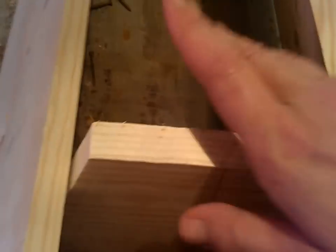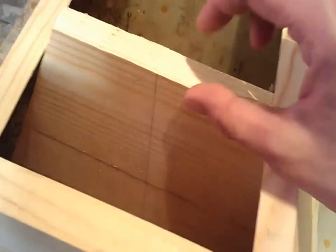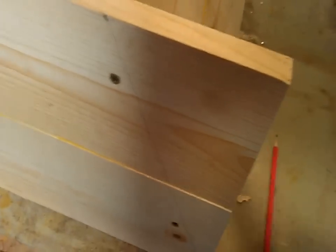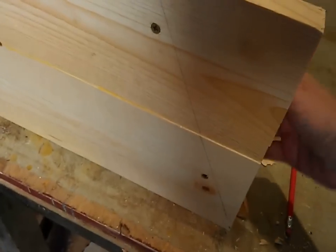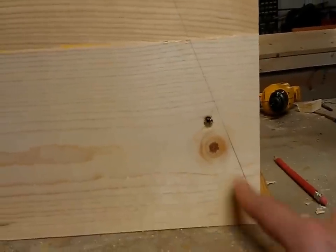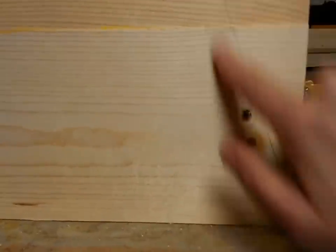To put your top bar together: this triangle piece here is 15 inches by 6 inches with one of the top bars screwed on top. You lay your board up against it and screw it in on the side using that big flat piece that we measured. For the top hole it's easy to screw, but for the bottom one I recommend taking a spare scrap piece of wood, marking the top and bottom, and drawing a line on the front so you know where to put those screws.